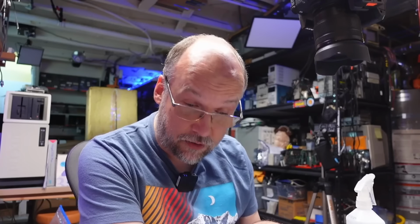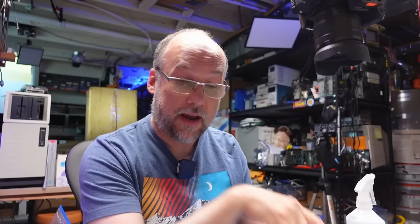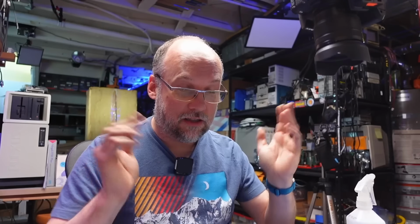So this video was a little bit of a rough start. Obviously, we've had a few different faults we've been trying to troubleshoot here, and I was kind of going down the path of thinking it was the video section, but then the tantalum shorted, which seems to have taken out the power supply. And then even though I removed the battery, I knew about that, I just kind of made the false assumption that the traces under there were bad, and that was just going to be for the battery itself, when the reality was we suddenly lost 5 volts to the majority of the ICs on the motherboard, which clearly set me off on a few wild goose chases.